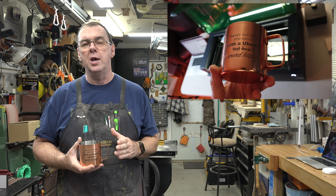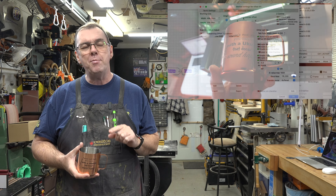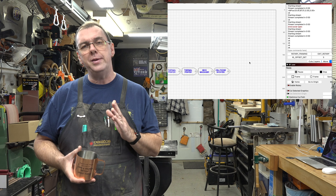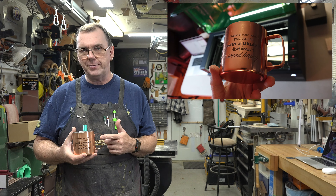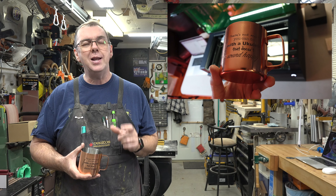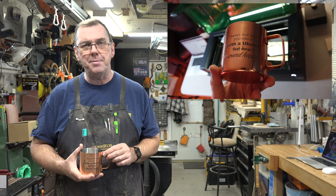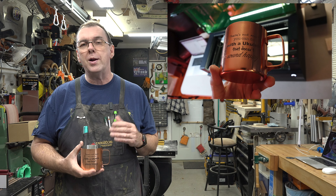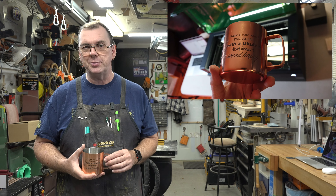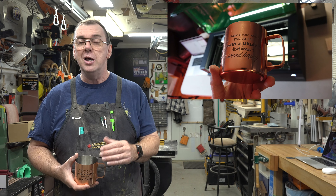With the S1 it's easy to look down into the enclosure — it's fully lit with integrated LED lights and you can see clearly how your design is going to work out. I had issues with the offset of the laser pointer crosshairs. When we initially set up the S1 in LightBurn that offset was turned off and we had to turn it back on. But using LightBurn with the riser and the rotary, for some strange reason the offset was never taken into consideration on the Y-axis, which is what the rotary controls. So there is some incompatibility between LightBurn and the xTool S1 combined with the RA2 rotary.